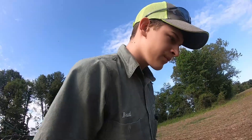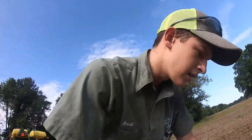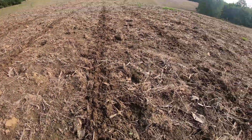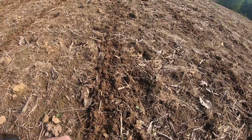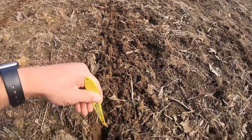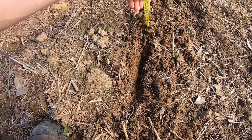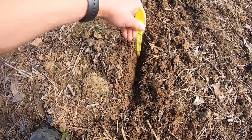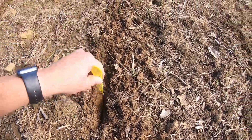The reason I came back here was to dig for some seed and make sure we're getting a proper depth. It is a little bit damp here this morning, but here you can see our Copperhead AG spike closing wheels that are doing really good breaking up the sidewall compaction. This makes for really good seed to soil contact - that's what you want when planting. You want seed to soil contact because then the ground temperature gets warmed up and that's what makes your seed emerge from the ground. I'm gonna have to dig for a seed here for a second.